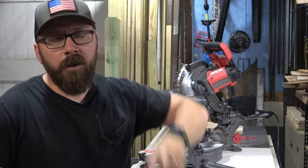I absolutely love this saw. It has taken over the primary saw responsibilities from my table saw — I just use it so much more, especially for construction-type work, but it also does a good job on fine detail cuts. My two favorite things: number one is the hold-down clamp, which is kind of unique. You just push down, hold, and it clamps your material in securely. When you've made your cut and need to move it over, it releases that quickly. A lot of miter saws in this price range have a screw-down version, which is a much longer process.